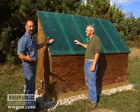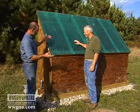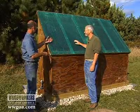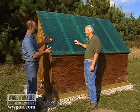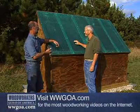So really what you've got here is a greenhouse. Basically a greenhouse. We're letting the sun shine in there, trapping the heat as best we can. And just the heat of the sun is going to heat the wood, drive the moisture out of it. Now, what about air temperature inside here?